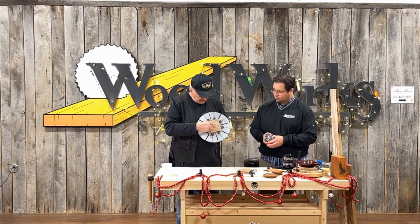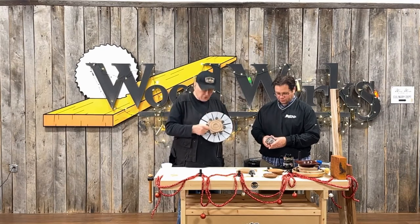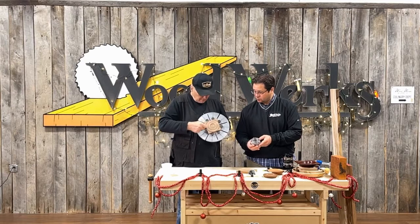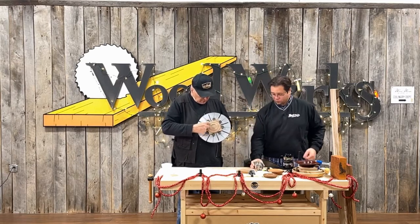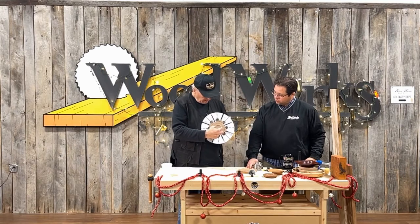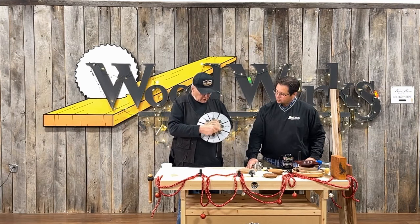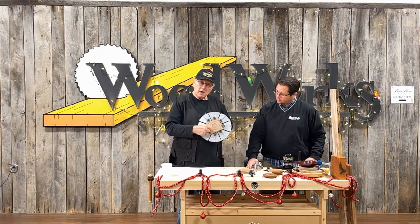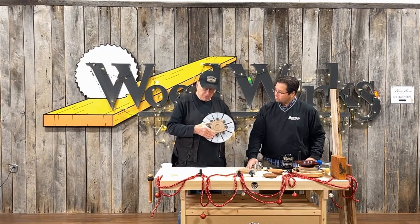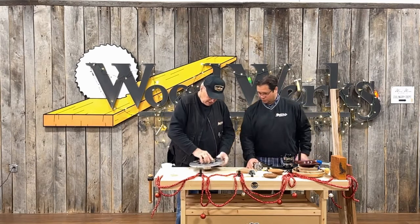So what I've done is I've turned a mortise here the size of my jaws, and I used a skew to make it a dovetail. And I described a mark here where this is going to be the rim of the vessel. And this here is just for convenience for me. It marks the diameter of the thing I'm going to make. This could be turned away while on the lathe, but for me it's easier just to scribe a mark, take it off.